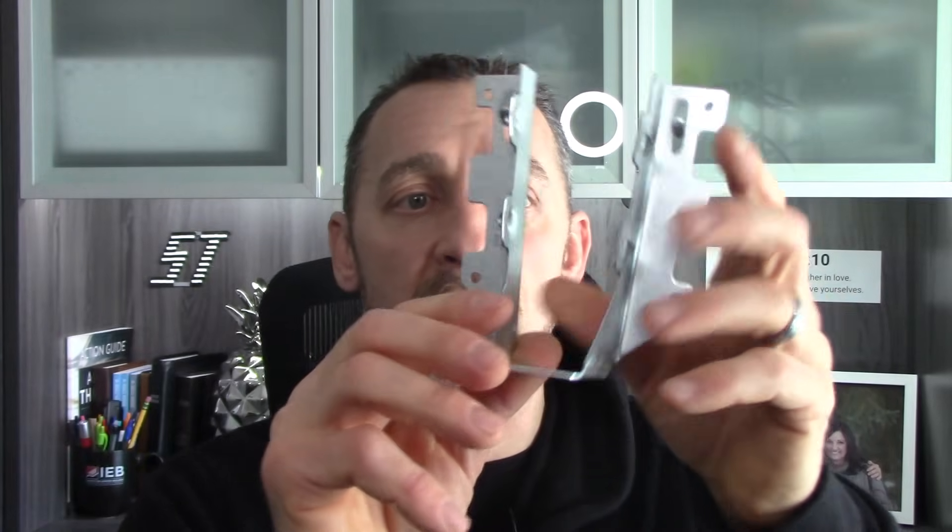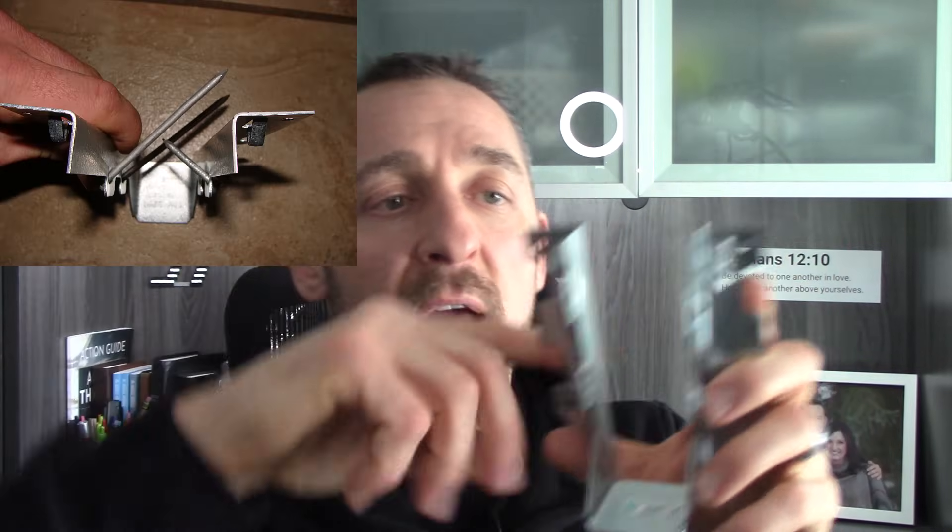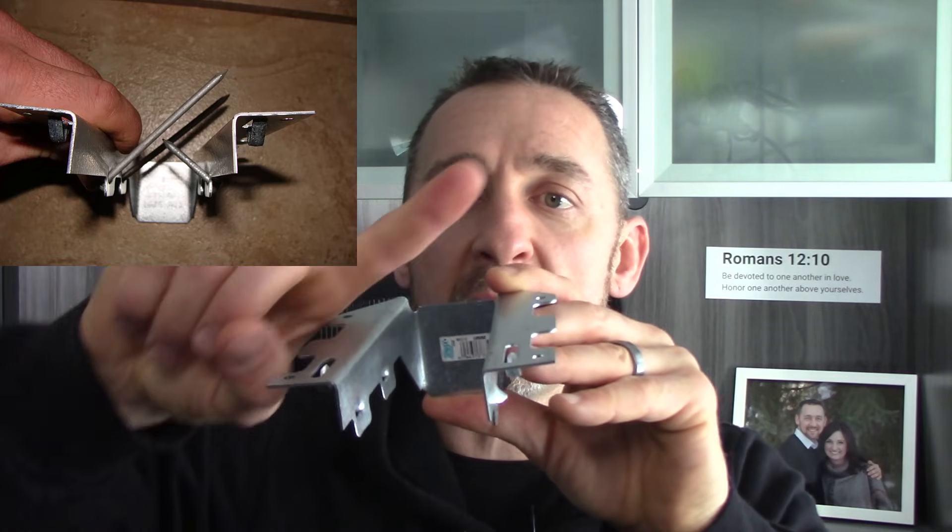It's especially important on the cross-shear nailing. Manufacturers design joist hangers where nails go in at a 45-degree angle — this nail goes through the joist and then into the ledger board, almost out the backside, for cross-shear nailing. If you're using the wrong short 1.5-inch nails, they don't even begin to go through the backside of the joist. They don't even touch the ledger board. Sometimes you'll have a small space between the joist and the ledger board and you can actually see the tips of the nails not touching the ledger board.